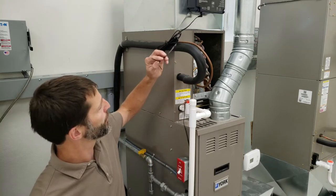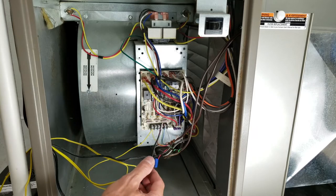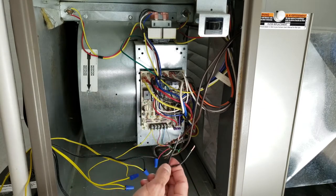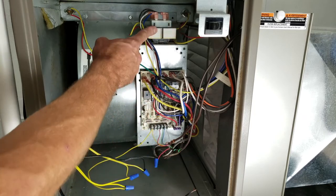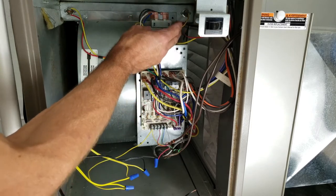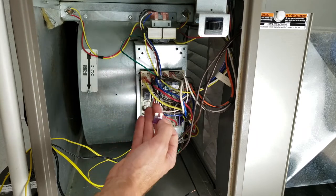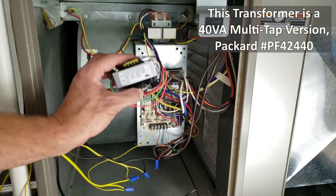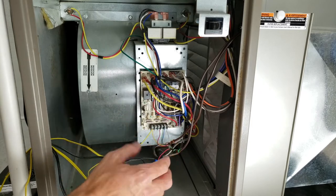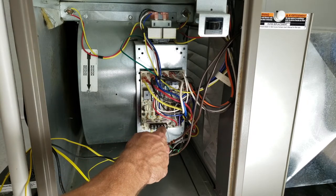In reference to the 24-volt wire, we're going to take our power from the lower portion of the gas furnace. In the lower gas furnace electrical compartment, we have our two wires and we want to attach those to R and C in order to get 24-volt power. You really want to look at your existing transformer — if it's a 25 VA or 30 VA versus a 40 VA, the 40 VA will handle more current. We also have a 3-amp fuse, so you just don't want to overload the transformer. In the case of multiple accessories or two UV lamps, you'll want to install an additional transformer to supply the 24 volts. The extra wires here are just condensate safety switches breaking the Y wire to the outdoor unit — attach one wire to the R terminal and one to the C terminal.